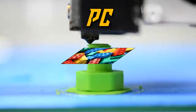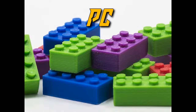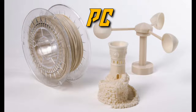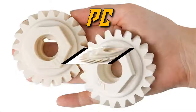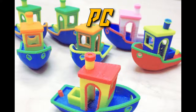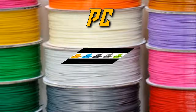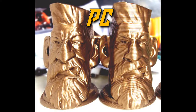What is PC? PC stands for polycarbonate, and while it may be the strongest on this list, hear me out before ordering a spool. PC is amazing — its transparent nature and extreme durability make it ideal for things like display screens, and it can even be made into bulletproof glass. The only drawback for the hobby printer is the high temperature required: 270 to 310 degrees C, meaning the minimum temperature is out of the range of most stock printers. You can in some cases upgrade to a higher temperature hot end, but it may not be as straightforward as it sounds. This filament also warps easily, so you'll need an enclosure. It's also hygroscopic, so store it in a dry box when not in use.